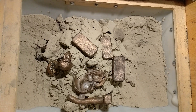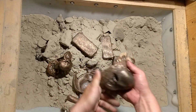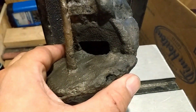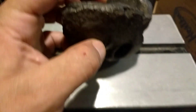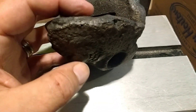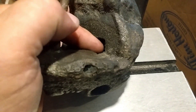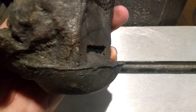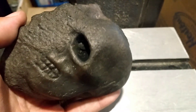The other one — pretty hideous. This doesn't actually look as bad as I thought it would when I saw the sand float. I think the loop came out quite nice. The hook is here. Unfortunately, there's a solid inch and a half of bronze between that and the other side of the casting. Look where the loop is here, and look where it is here — it didn't float on this side, it floated on this side. Such a bizarre type of casting defect.